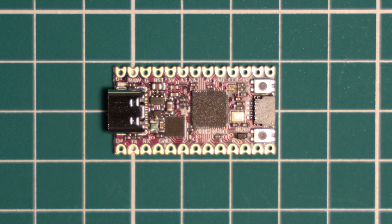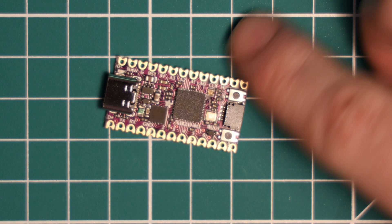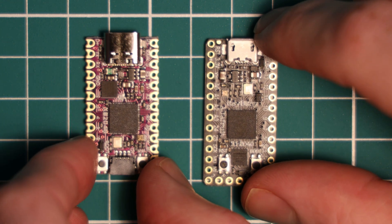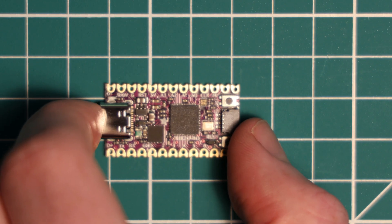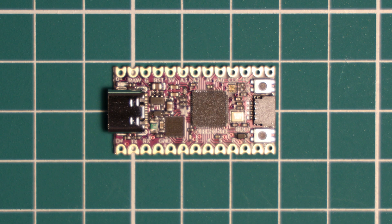In terms of conclusions, I like this Adafruit board. It compares a little in price to the ItsyBitsy RP2040 also from Adafruit's RP2040 lineup, but I think this board is more compelling because it's very similar in features yet has castellated pins, a very similar form factor, and a USB-C connector. I'm not a massive custom mechanical keyboard person, but having seen Adafruit's proposed uses for this board I'm actually considering making a custom keyboard or at least a keypad with it in the future.